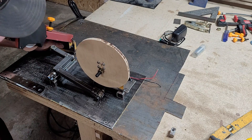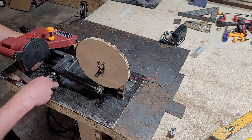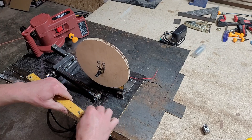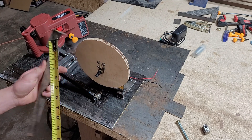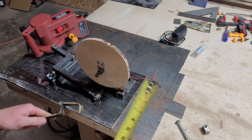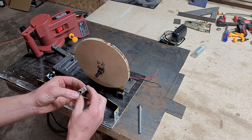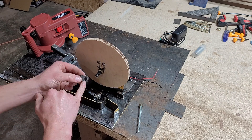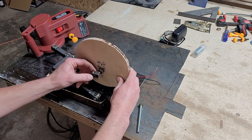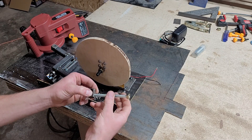The depth screw on the sharpener will ride right where I tacked a little washer on the end of this arm. To index the blade forward, I've got this arm and a couple of springs. The straight section is nine and three-quarters, stepping up about an inch, then over two and an eighth, then stepping back down an inch and an eighth. This piece has two holes — it's half inch stock. One hole is a 10 mil hole to fit snugly on the bolt, and through here is tapped M8 all the way through.